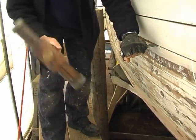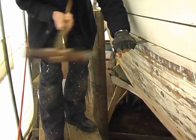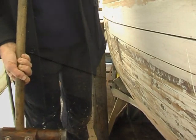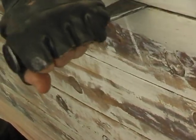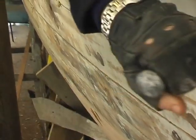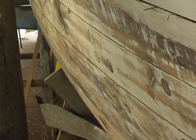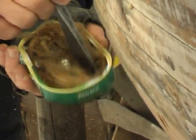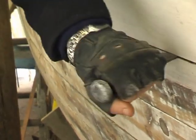The way you hold your mallet, you get a nice feel and balance through it, so you can see I'm putting not much effort into it. As I said before, she's been at the water for several years so she doesn't need to be whacked in that hard because she will swell up. With the first iron you use an iron with a crease in it and it's the same technique. There's another tip: if you get a situation where the iron is sticking in the seam, have a tray of John West herring tin with a bit of linseed, and just dip the iron in the linseed — that stops the iron sticking and jamming. Then you just run along like that.